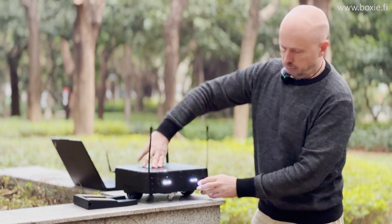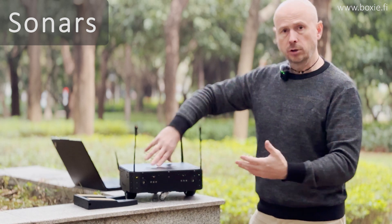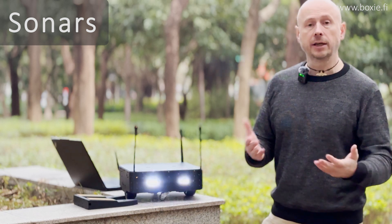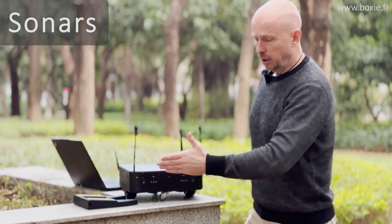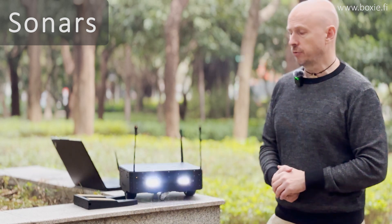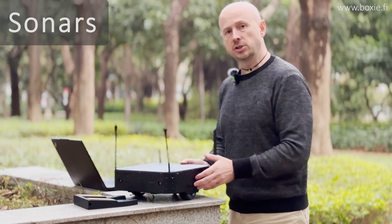Sonars are combined with the two omni-microphones, which is very powerful, because the robot may face situations where lidars are not detecting — like with glass, or when lidars are blinded by very powerful infrared. We have a secondary source of information. It's not as precise as lidars, but it's better than nothing. Sensor fusion is the heart of the system.